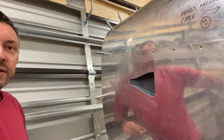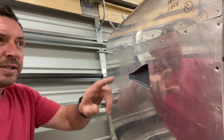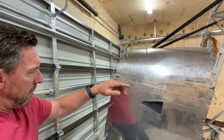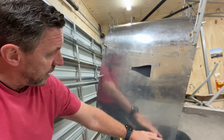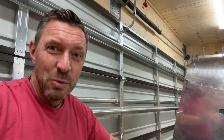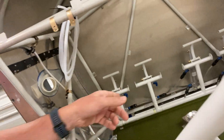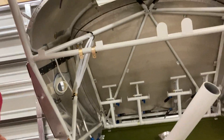Some more progress just in the last week: I decided to split this cowling here — the boot cowl. Now I can undo the screws and in about two minutes remove it, which gives me very good access in here to service the brake cylinders and the brake lines. Very happy with that.